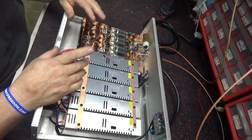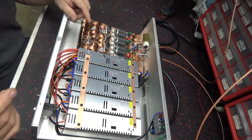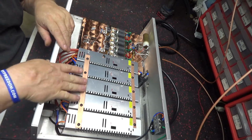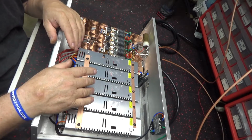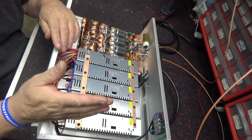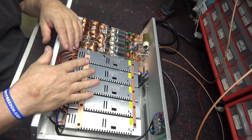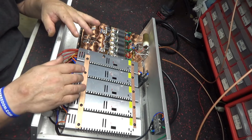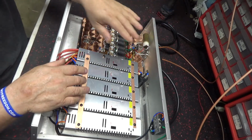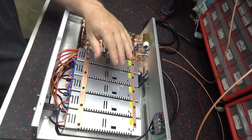We'll do a little short video of it running. My Cobra 29, my little amplifier here, which is my little test 2-pill. It's got 2290s in it. It don't do a whole lot because I don't want it to do a whole lot. I want it to be a little bit more than a 1-pill, but a little bit less than a 2-pill, if it makes any sense. Just four drivers already in line, stays in line all the time, so nothing changes what it comes out to be.